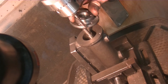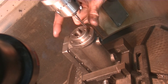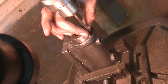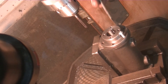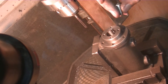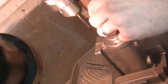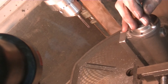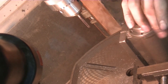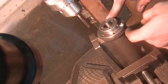It's a little close to the edge, but that's one of my faults sometimes with drawings in SolidWorks — many times the bolt holes end up in crazy places towards the edge, because I don't spend enough time modeling and bringing in the bolts and putting them where they should be. This isn't really one of the screws I would use because it's a cap head. I want to have a hex head, so let me cut this. Okay, I cut it down shorter. Let's put that in and tighten that up. Now that head is on there tight, so I'm going to drill through all these and then tap through all of them, and then we'll be done with this part.